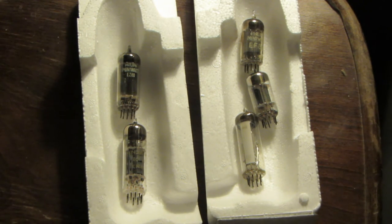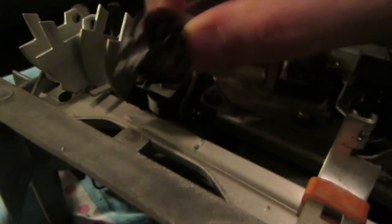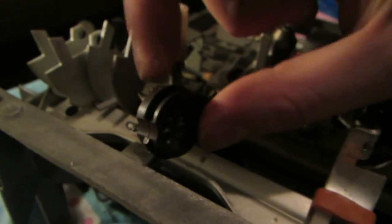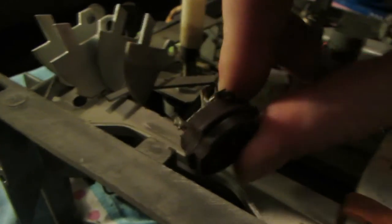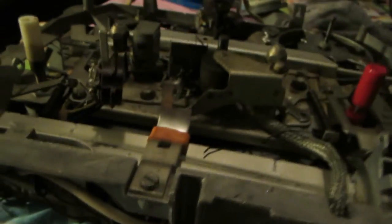I'm kind of thinking of mainly building a compressor or maybe a tube pre-amplifier with a cool little VU meter using this magic eye tube. Another very nice thing is that the tube sockets are mostly just free-floating or attached with just some rivets, so I can easily loosen them and use them for my projects. I'll just have to desolder all these wires, or maybe I'll just leave the wires on to prevent damage, since they're already wired in the correct configuration for the tube.